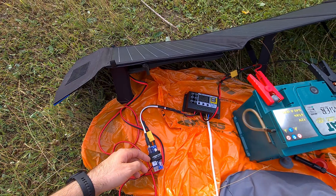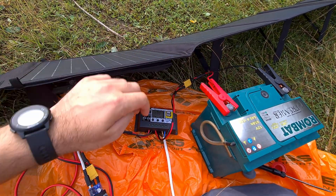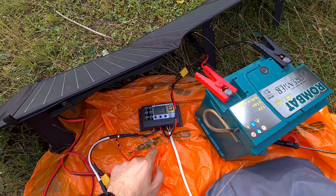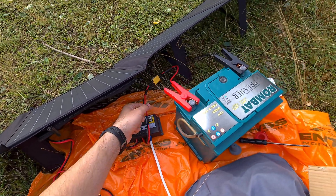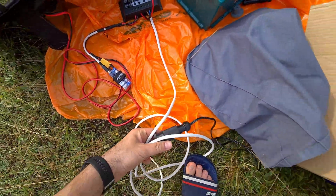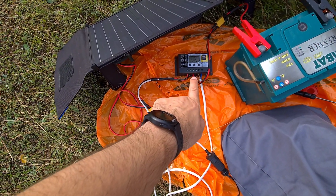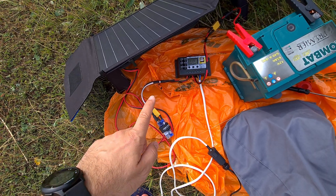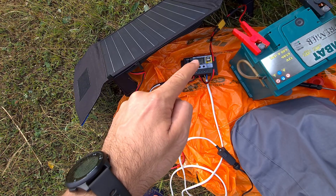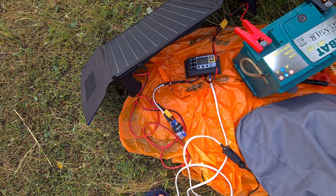Just ignore that — that's just a USB output which works all the time, because these USBs require a battery. If you don't connect a battery to the solar panel and controller, you can't use those USBs. Power from the solar panel enters here at the first two terminals, exits at the second two into the battery plus and minus, and also exits at the third set through white cables to the fridge.